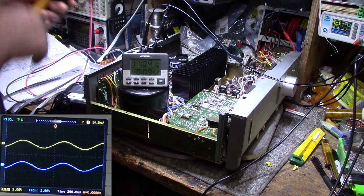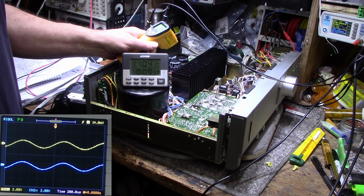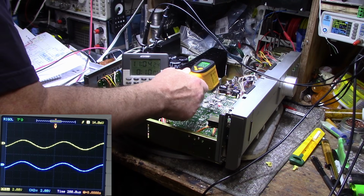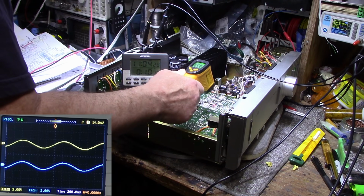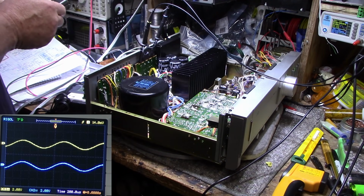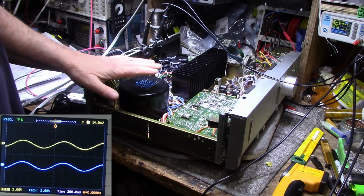Okay. Transistors around 70, 75 degrees, 77. So they're doing pretty good. A lot of heat on this board too. It was up around 70 degrees on these transistors here, this heat zone. So a lot of heat, yes, but it lived up to the reputation. So I'm gonna let this cool down, and we're gonna get some square waves and we'll see how it looks.